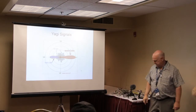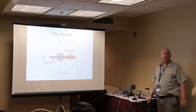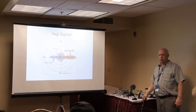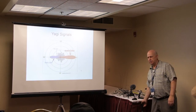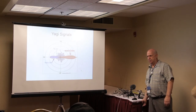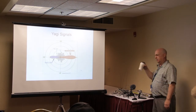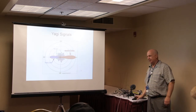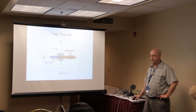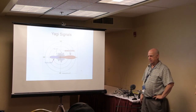On that tape measure Yagi, how broad is the main lobe? It depends on the strength of the signal. You learn it. I mean, how far can you swing before it really drops? It's the same antenna, everybody, one guy designed it. I think it's a W2 somewhere. And it really doesn't even tune to 146. He kind of made a mistake, and everyone built the same antenna, so it's really off beam where it should be. But the beam width is actually really good if you're far enough away.